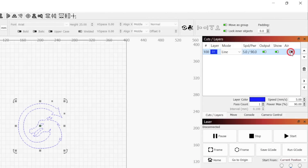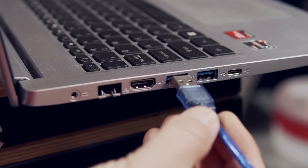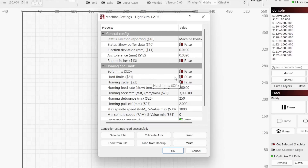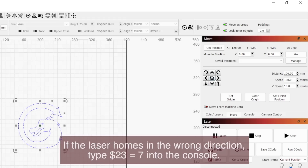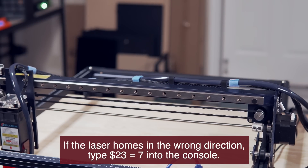Now you can enable Air in the Cuts and Layers window to turn Air Assist on for that layer. To enable Limit Switches and Homing, the S30 needs to be powered on and connected to Lightburn. Clicking on Edit in the top toolbar, select Machine Settings to open the Machine Settings dialog window. In the table, we need to enable both the $21 hard limits and the $22 homing cycle. To enable, click on the red toggles to the right of the values to turn them to green and true. Then click Write to update the values on the laser's controller. This will be a fairly quick process and the text below the table will read Controller Settings written successfully when completed. Click OK to close out of the window. Now, when you go to the Move menu and click Home, the laser will home to the front left and you will also be able to use the Absolute Coordinate Start From mode.